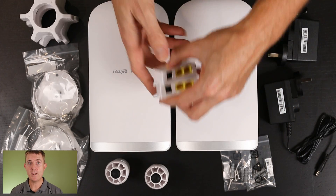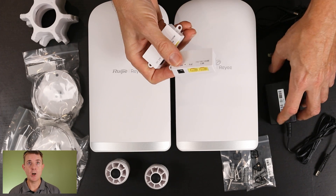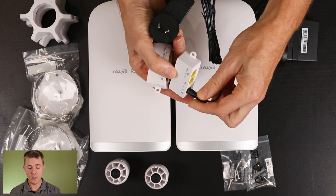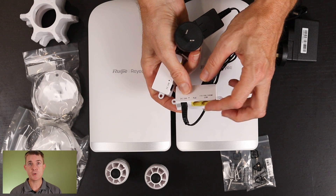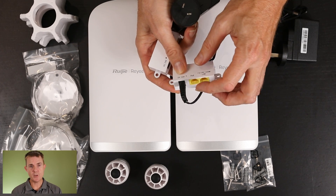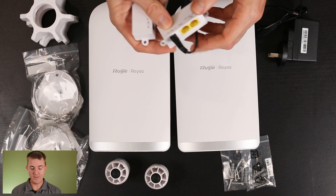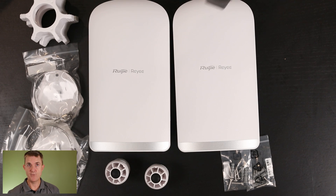You are going to get two PoE injectors. These can be 24-volt PoE powered. We take our mains power — this is our Australian power pack and input cable here — that will go out to the mains. We're then going to take our connection from our router or maybe a switch, and that's going to go in this side. Out from here is going to be an ethernet cable that can be up to 100 metres long, carrying data and power out to the outside wall where one of these is facing the first building. In reverse, this one is mounted on the other building. You get two PoE injectors for two devices and two power packs for two devices.